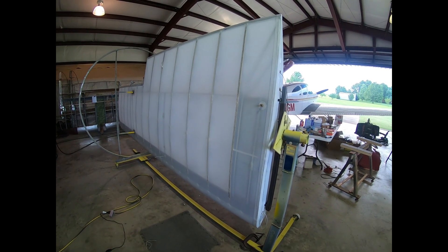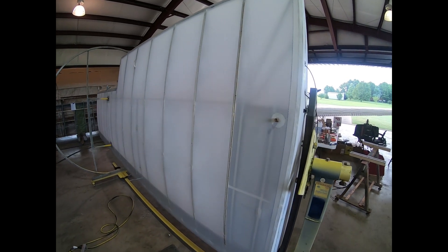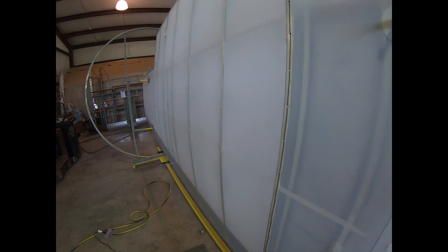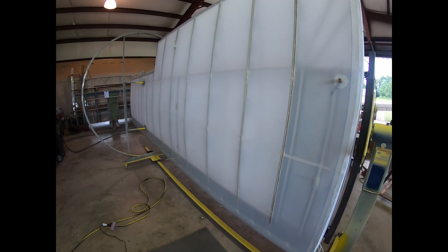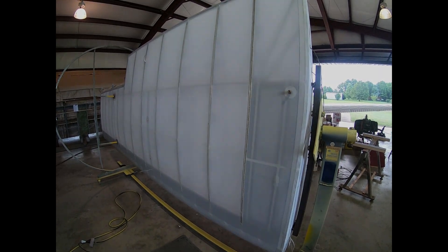What I'm doing now is what would be rib stitching on a normal airplane — on the TaylorCraft it's done using a wire clip instead. I've got one installed and I'll show you how I'm doing the others. First I install the reinforcing tape on top of the rib, then I use a little wood burning tool to burn through the fabric where the holes are so the clip can go into the holes. It melts a nice round circle and makes it really easy to put the clip in place.